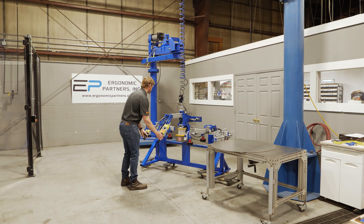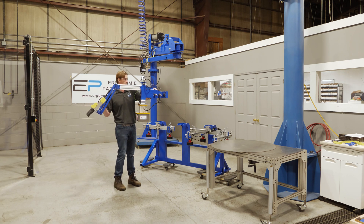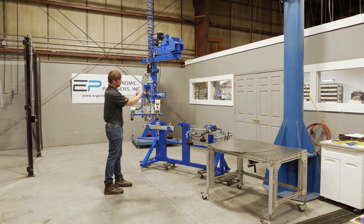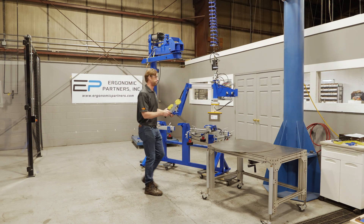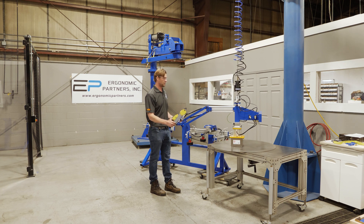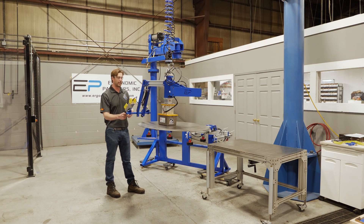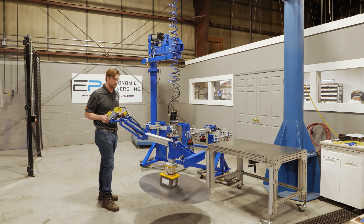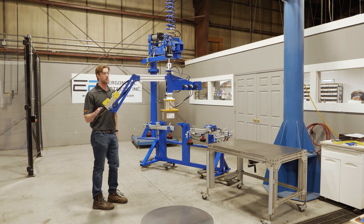Once you swap this out, you want to lift it up just a little bit and slide it out. You're going to want to turn the air pressure up on this pressure regulator to 90 PSI, otherwise this magnet won't actuate. This single magnet is good for 200 pounds, so if you have a heavy, thick, smaller plate, this is the ideal magnet for that. With the quick disconnects, you can set this down to the ground, release the part, and stay in a good ergonomic position.